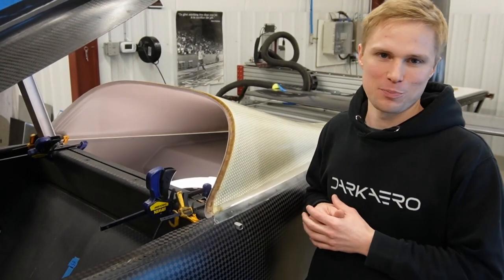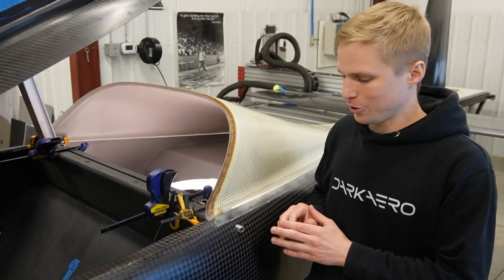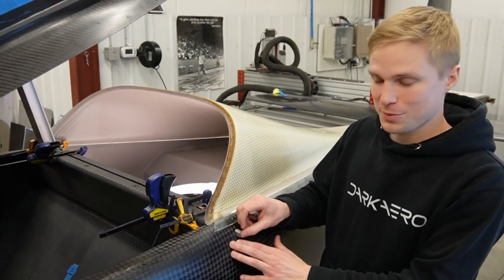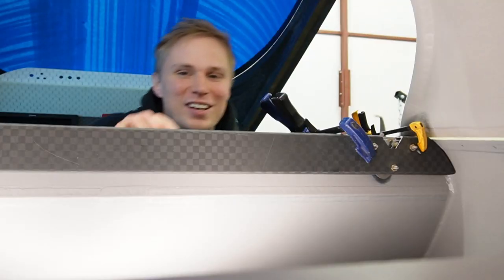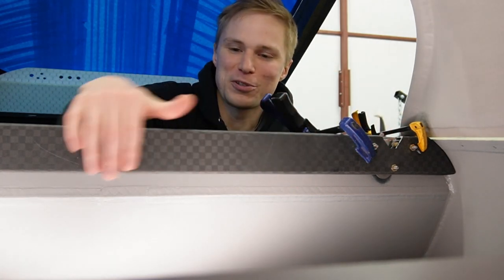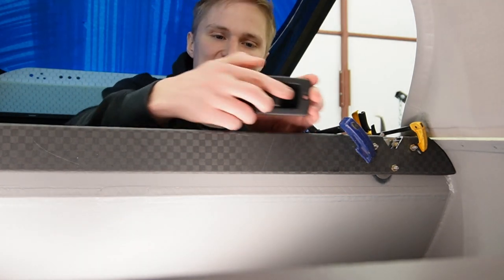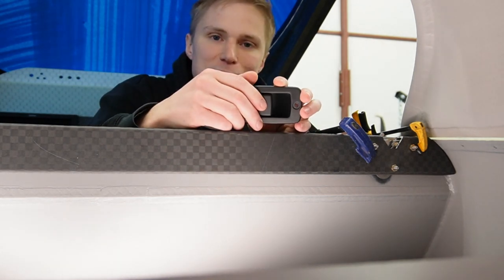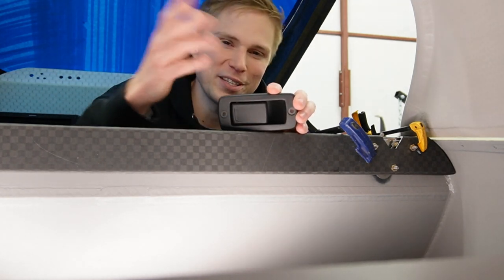Here at the cockpit, the latch system is in place, and the aluminum tube I mentioned earlier is now protruding from the fuselage — this is just temporary until we have a button to engage with our latch system. Moving inside the cockpit, you can see the latch assembly clamped into position. Over the top of the whole thing we have a carbon fiber cover that ties everything together and protects the aluminum tube from being accidentally engaged. Later we'll be adding a cable-driven handle that will allow us to open the canopy from inside the cockpit, but we'll save that for a later video.